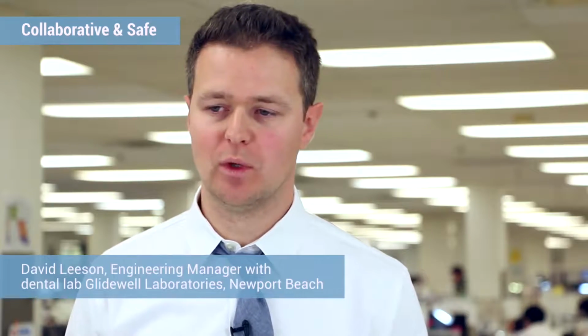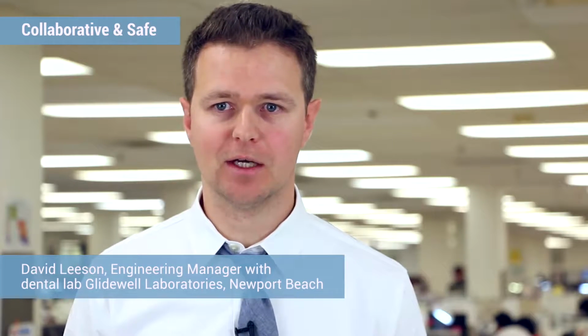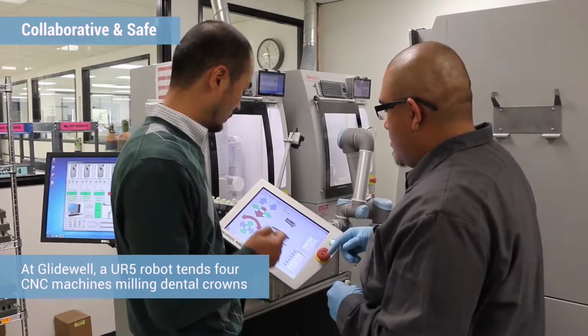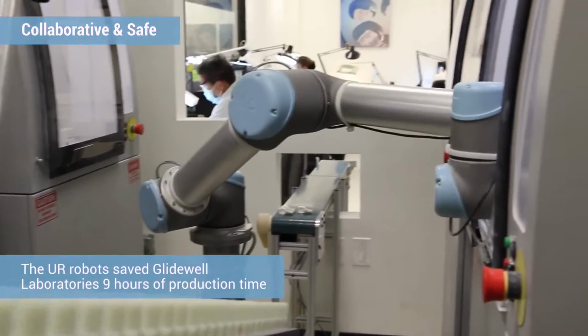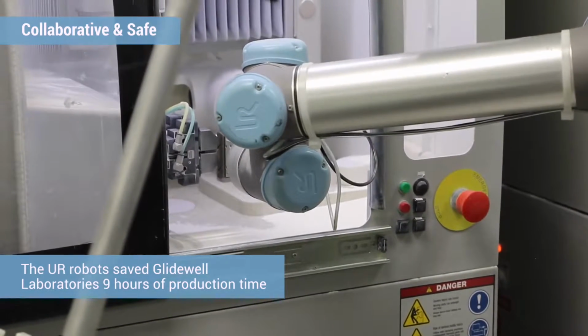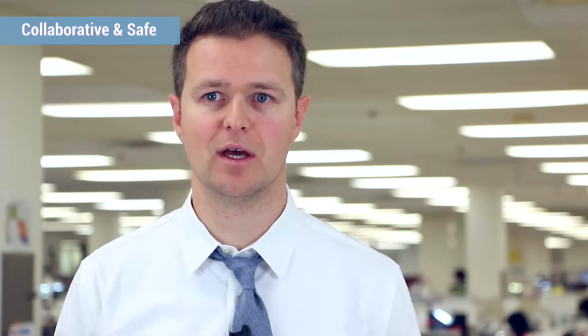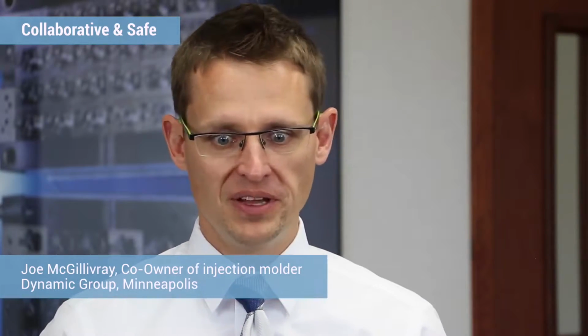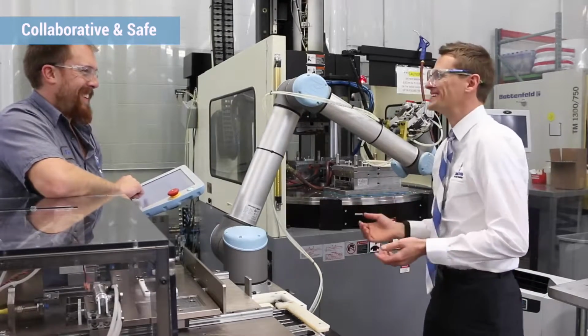In our history of automation here, we've used conventional industrial robots. And we had to build a large enclosure to separate the people from the robot, which takes a lot of space. It's extra cost, it's less flexibility. It is a safety concern. If someone defeats the interlocks on a robot enclosure, we don't have to worry about that with the force sensing in the Universal Robot. I asked our partners, Bros, to show me how the safety system works, and we wrote up a program that allowed me to walk in its way as it swung back and forth. I was pleasantly surprised. It didn't hurt, and it sensed me immediately and stopped, just like I'd want it to. The robot's very sensitive to outside force, so we really like that, because it's one thing, again, to say that the robot can be used without guarding, but it's another to use it safely without guarding.